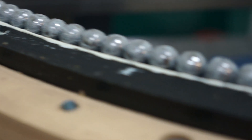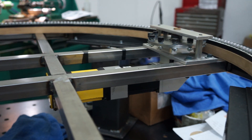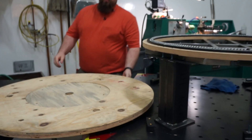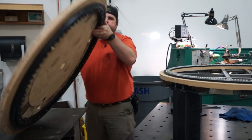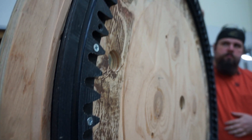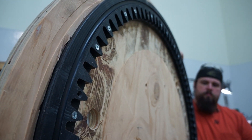We put down our lower section of raceway, fill it full of ball bearings and some grease, and then our top section of raceway has the teeth cut into it at the same time as our raceway was cut, so we know we're perfectly concentric. As we put it on our lower raceway we know that we're going to stay exactly centered.